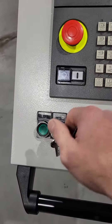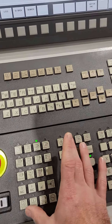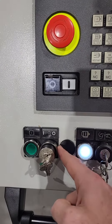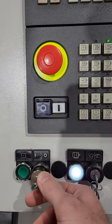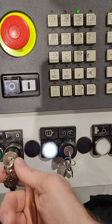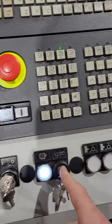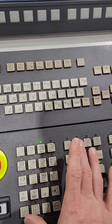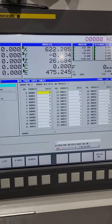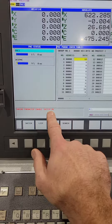Then go into MDI mode. Let's try that one more time — Cycle Stop and Jog. Go to MDI mode and turn the safety key to the right. Make sure this one's up and down and this one's turned to the right. Jog and Cycle Stop again, then go into MDI mode and it opens it up. Now 66 — parameter enable switch on. So that's good.